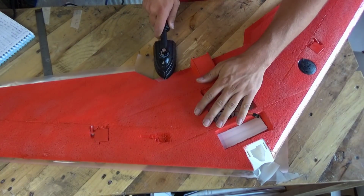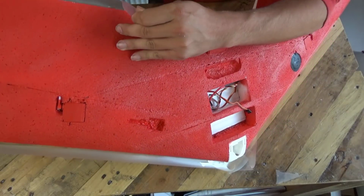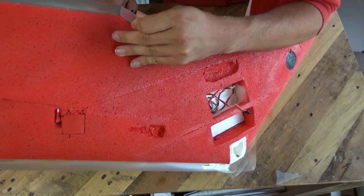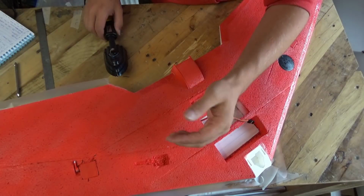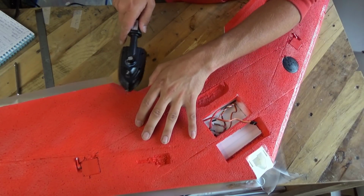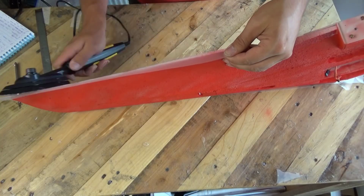Now, can you also remember what I said back at the beginning as well? Always do the bottom first, and the reason why you do your bottom first is because you use the bottom as a warm-up. So when you get around to doing the top, you are going to be an absolute pro at laminating, because it only takes 1 or 2 models, and you've got the swing of things, especially around the corners. If you haven't done one for a while, again, start from the bottom, work your way up, and then you get all your apprentice marks out of the way, and jobs are good in.